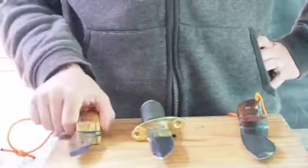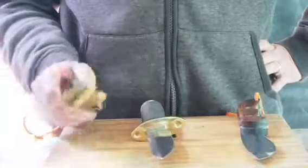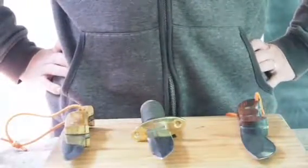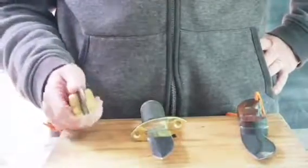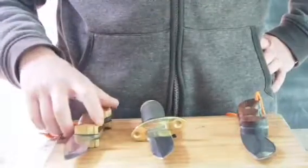To start with, over here, Timberwolf, Gary Mills Timberwolf. This is a scandi vex, technically a scandi grind knife, the sort of thing that's been made highly popular by Ray Mears and Alan Wood. This one is roughly a 4-inch blade, 4-inch handle, curly birch, O1 tool steel, and it's been done by a stock removal method.